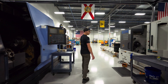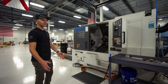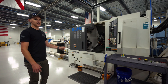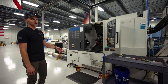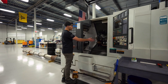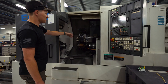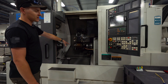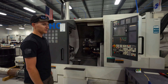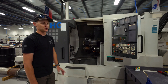Down the line is more of the same story. This is more of a job shop machine we use for suppressor components. This is an NL — it's the exact same machine as the NLX but a 2006, a little bit older. As you can see with this one open, we've got twin spindles, a turret, Y-axis, and all of our turning tools mounted in one location with live tooling. We're able to do cross holes, flats, all of your really complex milling. Muzzle devices and stuff like that come complete out of this machine, which is really neat.